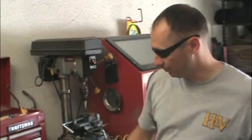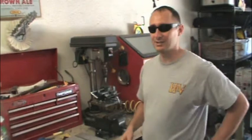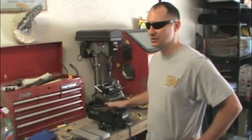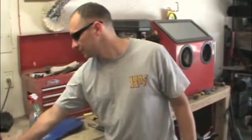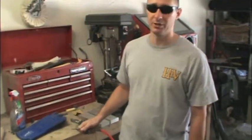We're going to pull it out — you want to use some kind of heavy duty fire gloves, either bunker gear structure gloves or some kind of welding glove, because it's extraordinarily hot inside the kiln. We're going to set it in the plates and vise it, or clamp it down. You can also use basic carpenter clamps — anything that will hold the blade tight within the plates. Then we're going to use some pressed air in what's called a forced air quench, and just blow it between the plates.